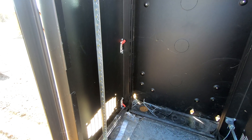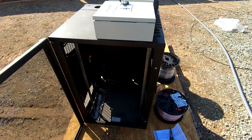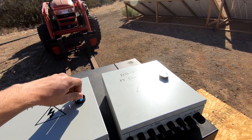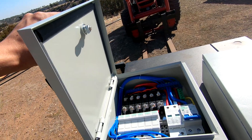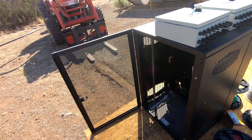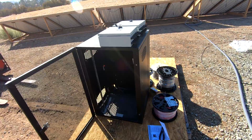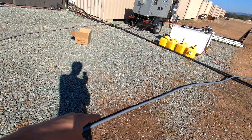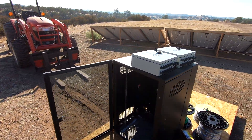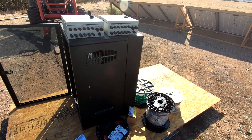This is not an outdoor-rated enclosure, so it still allows some airflow through here to keep the diodes on these panels cool. It also helps with the fact that the gaskets on these combiner boxes don't go all the way around — I really don't trust the weatherproofing of these enclosures. But it allows me to lock everything up and keep it all nice and clean. Then I'll just have a seal tight coming out — that one I have laying on the ground already, sitting in the sun to loosen up a bit — and that'll go to my charge controllers in the electrical room.